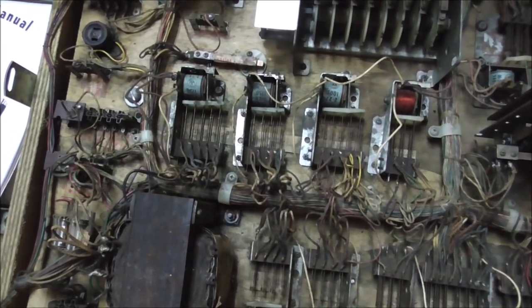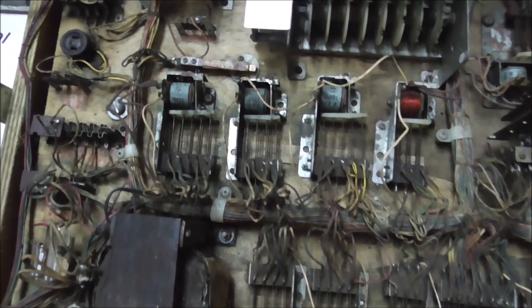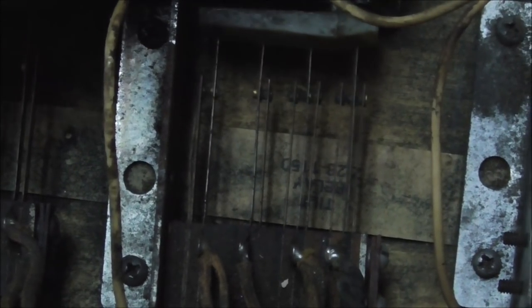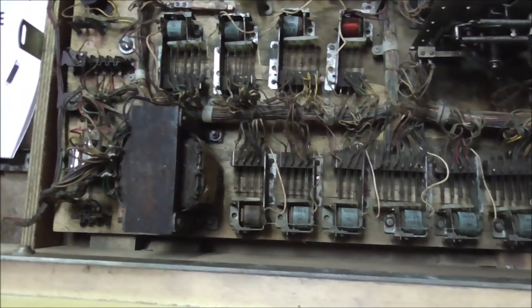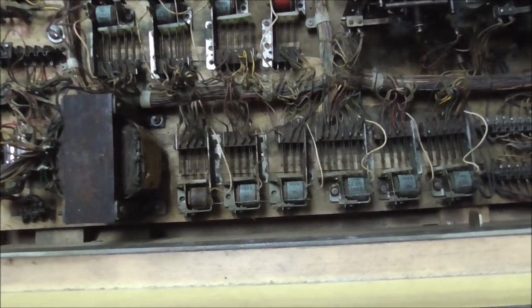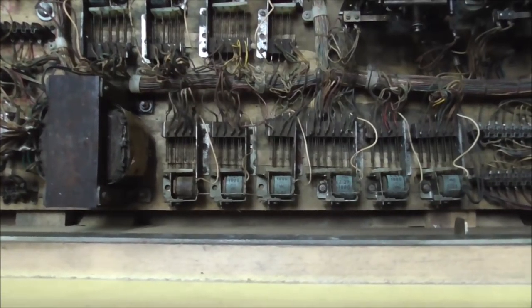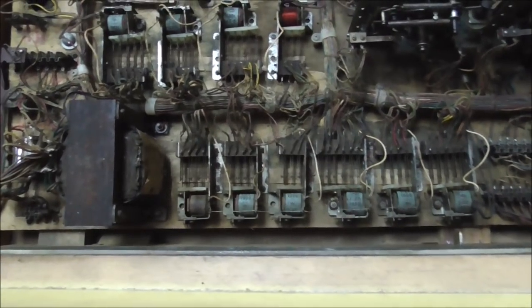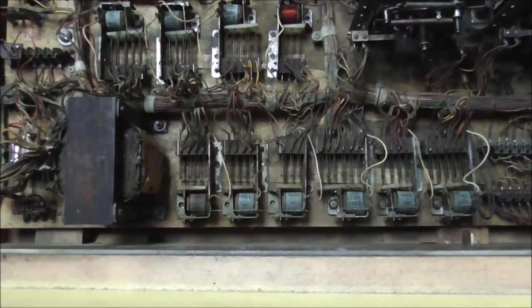The ones we were just looking at were all working fine, so I won't adjust those. When the blade moves, you want the smaller blade it touches to just barely move — it rubs the contacts together and they clean themselves a little bit. The problem is these things sit around for maybe 30 years and get dust and dirt on the contacts, so they no longer electrically conduct. The good news about these electromechanical machines is you usually don't have to buy many parts — but you've got to clean all kinds of stuff.